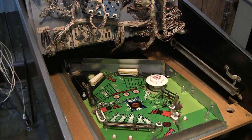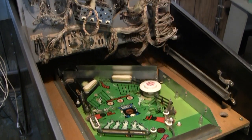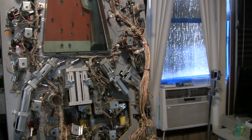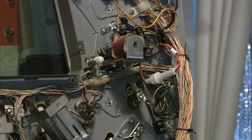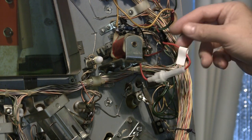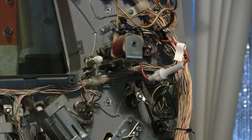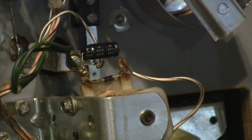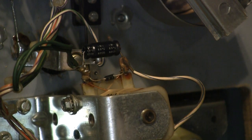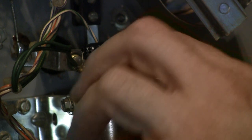Before I get to that, I'm going over everything else in the game, and I'm discovering a bunch of interesting things that are different from the standard game. For example, somebody has put inline fuses on the pop bumpers — kind of interesting. This game has been modified in some ways I hadn't seen before. I also see some electrolytic capacitors put on some coils, which I assume is to arrest the reverse current. I don't know if that's stock or not because it's only on a particular coil.